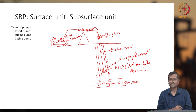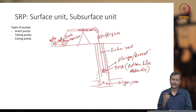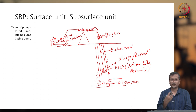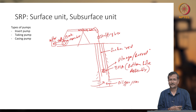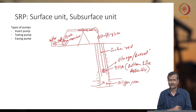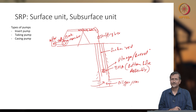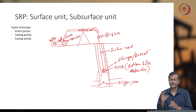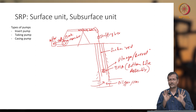But if a wellbore is giving regular failure, then that wellbore you have to study. Sometimes there is a problem well. Problem well means you install a certain pumping mechanism, again it will fail, and engineers will be repairing again, because for one reason or another the system will fail. But the engineer's target will be not to fail. Maybe you will get lower production, but the system must be stable and not fail for a longer period of time.